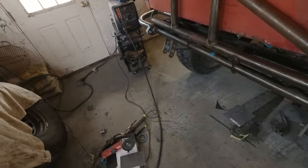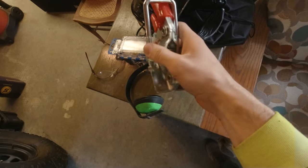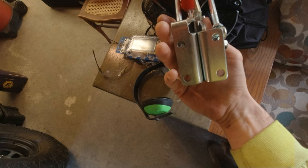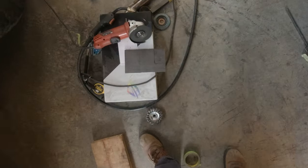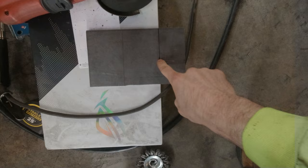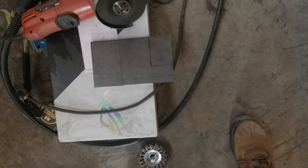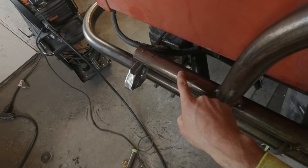That's pretty exciting. Next order of business, possibly last order of business besides paint, is to get this latch on there. So it's got a square bolt or hole pattern on the back here. My plan, as I kind of went over in the CAD video, is to cut a piece of this. This is 3/8 mild steel. I'm going to cut a piece about the size of that back plate and then drill and tap four holes